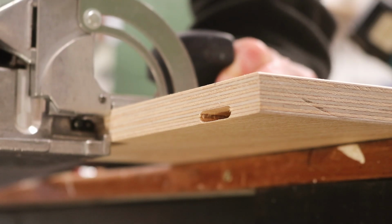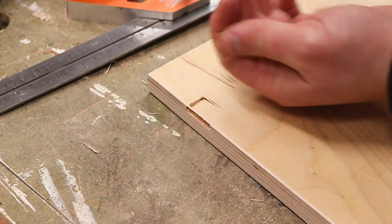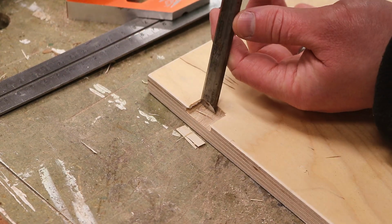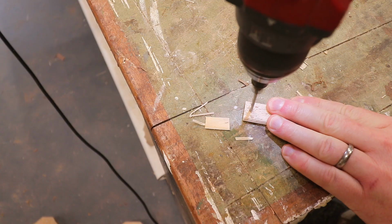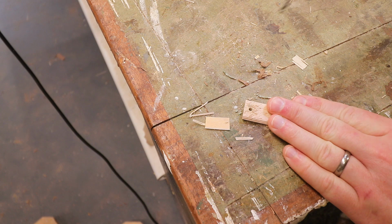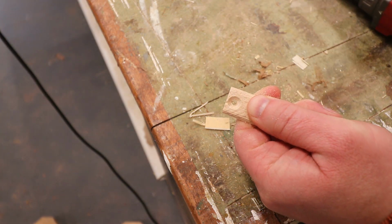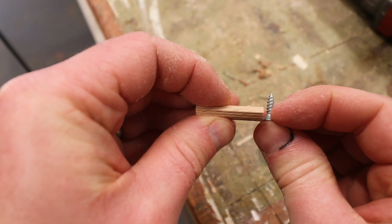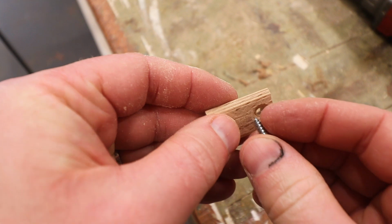After making the cuts, I still had a very thin layer of material, so I removed that using a chisel. And as you can see, the domino fits in there nicely. Taking this a step further, and this is optional, but it'd be nice to lock the shelves in place, so I'm just drilling a pilot hole with a countersink in the ends of some of the dominoes. And then I can find some small screws which will just poke through into the shelf from beneath.